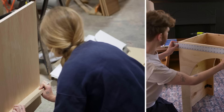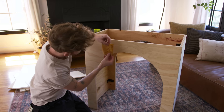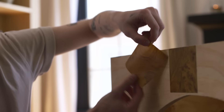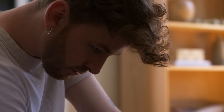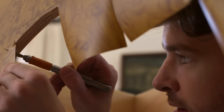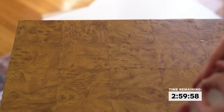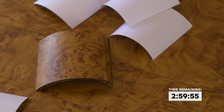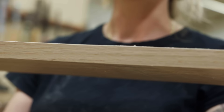I'm planning on sanding the white melamine material off and applying a red oak veneer — you just peel it off and stick it on. I've never used it before and I'm super excited. Honestly, it's so easy. I find the exact center point of the piece, place my first square, then work outward so it's even on both sides. I maneuver each square to find which grain looks most different from the previous one. I'm going to be edge banding a lot of the dresser to create a faux effect that the piece is made out of real wood. Now we have a nice wood finish on the edge and definitely getting vintage vibes from this burl wood — it has almost an antique toning to it.